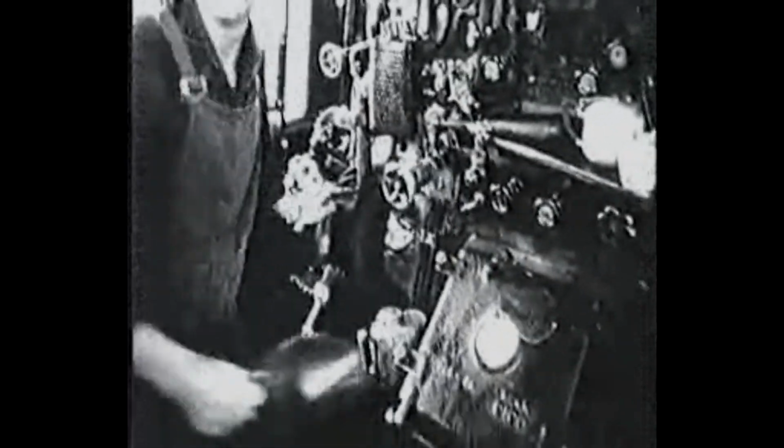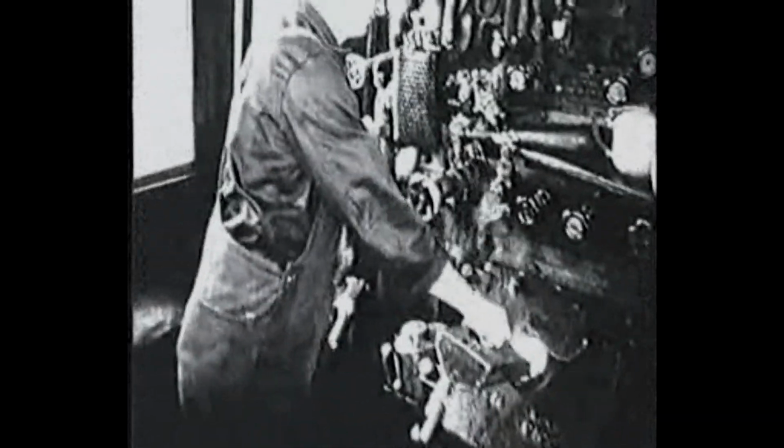The fuel oil leaves a coating of carbon on the boiler tubes, which slows down the heating of the water in the boiler. Sand is poured into the firebox, and the draft from the exhaust sucks it through the tubes like a sandblaster, removing all the carbon. Railwaymen call this tubing out.